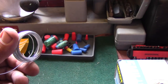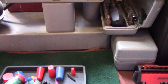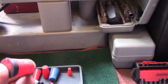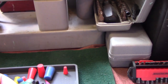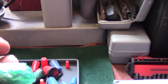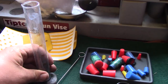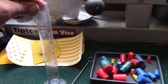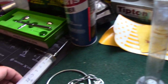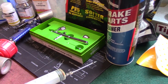This is just regular little wire — cheap wire you can get at Walmart — and I use that for hanging instead of buying more expensive hooks. These plugs here you can look up as powder coating plugs on eBay or Amazon; they're for high-temperature powder coating to plug your bore on rifles or pistols. For a 12 gauge I just wrapped with high heat tape to get it to fit. You do need something to mix in and it needs to be glass — this is just a glass 50 milliliter cylinder from eBay. Then I use a regular turkey baster from Walmart, about a dollar, to measure the hardener.